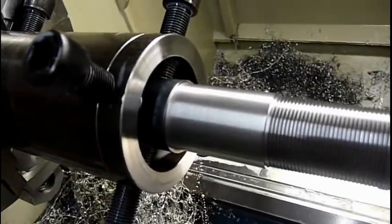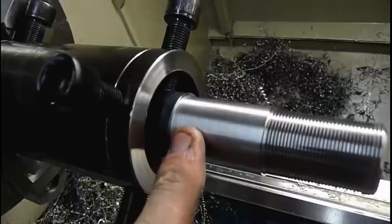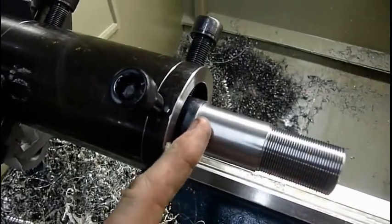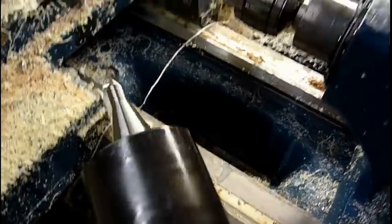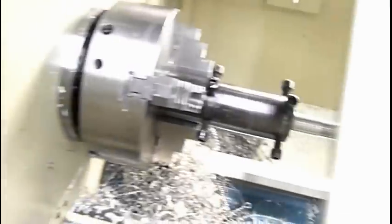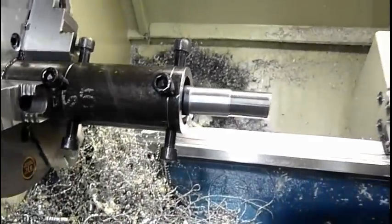It's running perfect. As you can see, this is the original barrel there — the rough finish barrel blank finish — and this is what it's going to be turned to, which is 1.125. I turned this so that when I grip on it, I can grip on this diameter and not grip on the threads. I can grip on this diameter, dial in on it, and then put the muzzle in the center using a brass bushing so I don't mar up my rifling, and put it in the tail stock. Then grip on that barrel shank in the chuck and slowly turn the whole diameter of the barrel down. There might be a little mismatch, but I'll blend and polish it by hand, and it'll come out perfect.